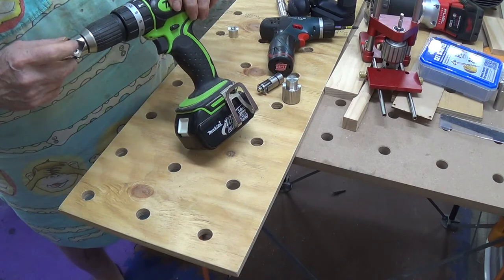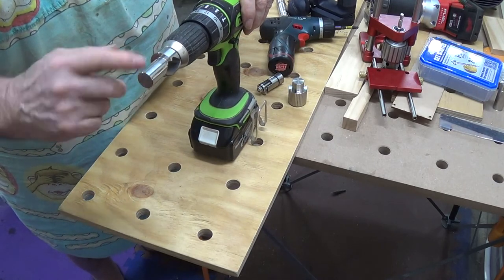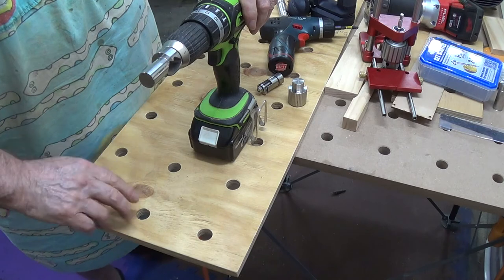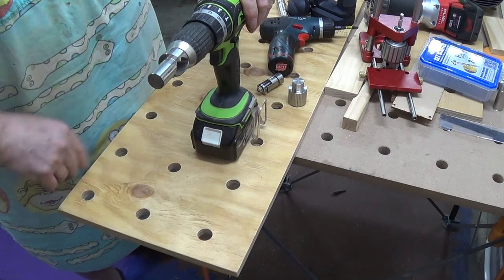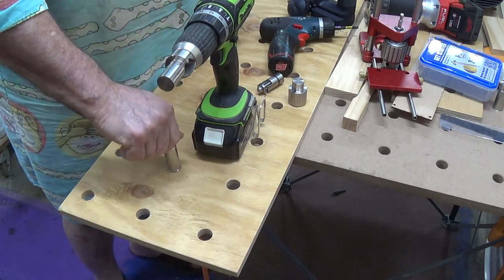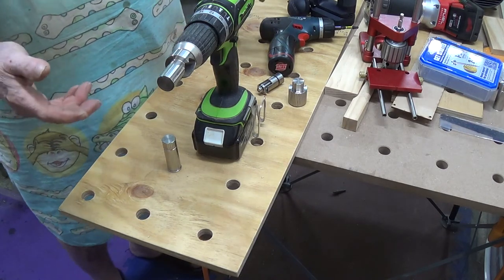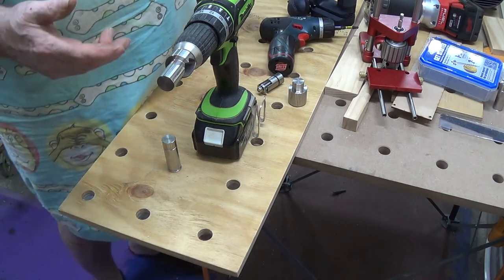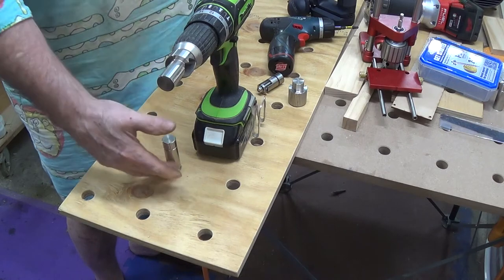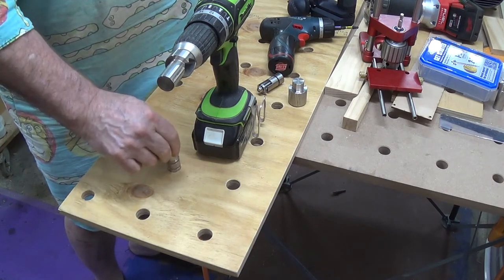It's got the chamfer bit on there, much like that one has. However, it's also got a reamer on the edges, because over time wood will swell, or could swell, to the point where it's going to get all ragged and hairy. This chamfering bit will clean that up. Now, with these dogs, if the hole expands, meaning the hole gets bigger, doesn't sound right, but anyway, it'll self-center and jam up. However, if it gets furry, you might find that this just doesn't want to go down.